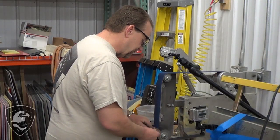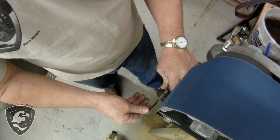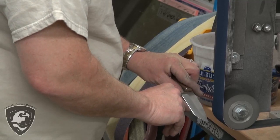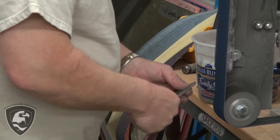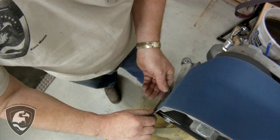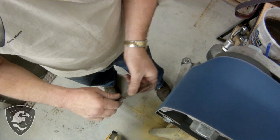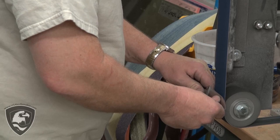As I'm making my passes, I'm trying to keep even pressure and I'm rolling around that belly of the knife right there. I want to keep that grind line even all the way along the edge including up top, so I actually roll and twist my wrist a little bit. I'm starting to get it thinned down — I'm down to five or six thou. No heat yet. Nice and sharp, and I can start to see the convex taking shape.